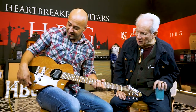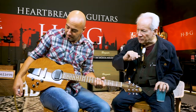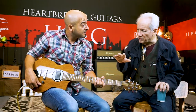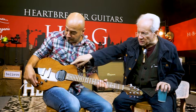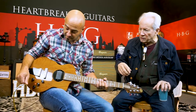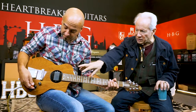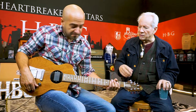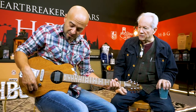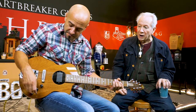Now, what are these guys down here? Okay. The switch turns on the active semi-parametric equalizer. Down at the bottom there, if you go full clockwise, you have 12 dB of boost at whatever frequency that middle control is set to. Okay. So try going all the way back? Yeah, try going all the way back with that cranked all the way up.